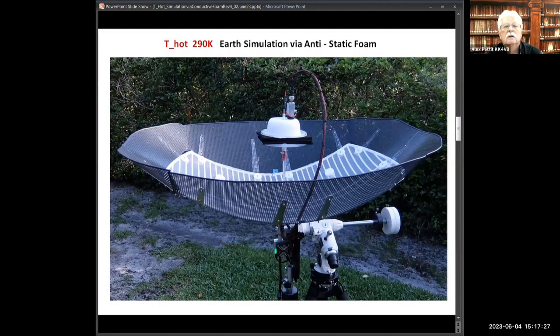It's easy enough to take that envelope apart. The little plastic package opens from the bottom. It's sealed together with like an RTV or something like that, but you can open it up and take the two sides of the dipole apart, and you could extend it out. Yeah, I'll give that a shot and see what happens. The other thing is I'm not sure that it's optimal: it uses a quarter wave stub, so that has to be really mistuned for 1.4 versus 2.4.